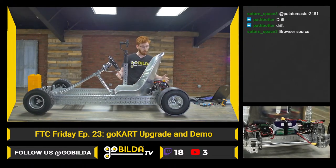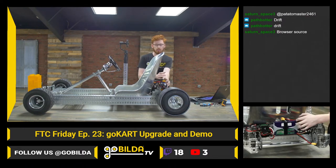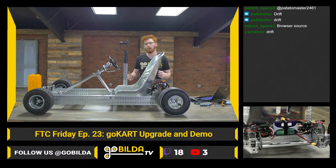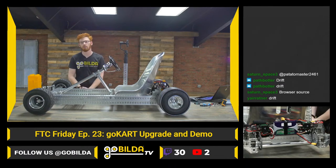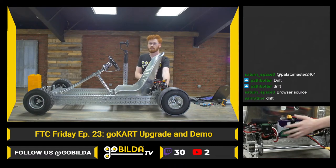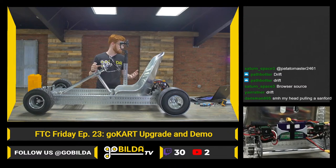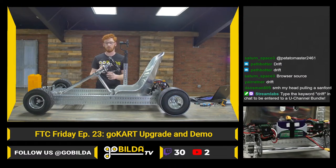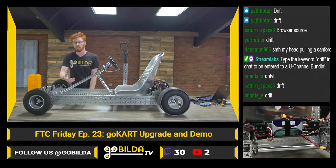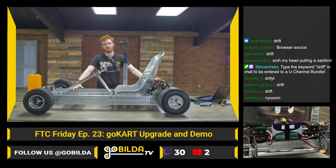So we can start with the powertrain here. Over in the back, we have our two batteries. Those will be the first thing you'll probably notice. They are two lithium polymer batteries, LiPo batteries, and they're 5 amp hour. The big reason we use these in projects like this is that they have a really high energy density. You can put just a ton of capacity in a really small space, and they also just have a crazy high discharge current.